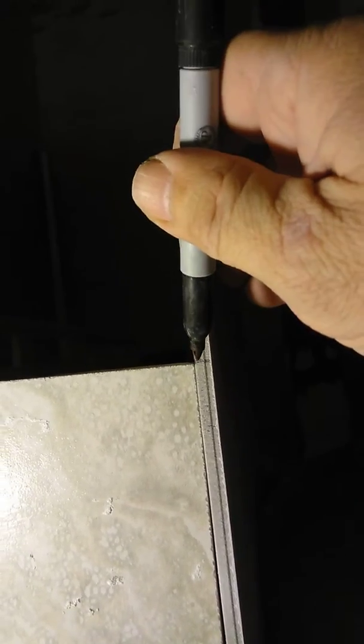Okay, I'm going to show you how you find your points without using a tape measure. You get your head at the same level as the piece you are going to connect, and then you sight them in. You look straight across to where this horizontal piece meets and runs into this vertical piece here where they cross, like looking in the crosshairs of a sight if you were hunting. Okay, so you sight it in with your eye.